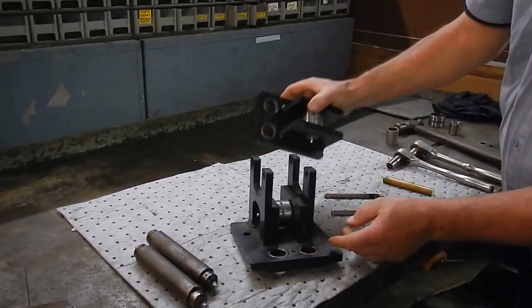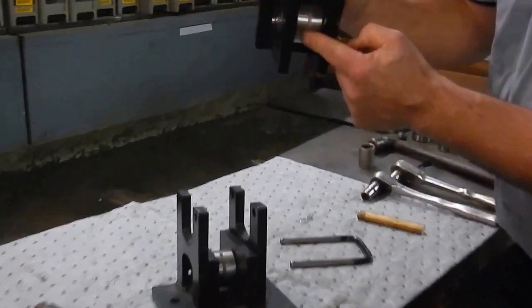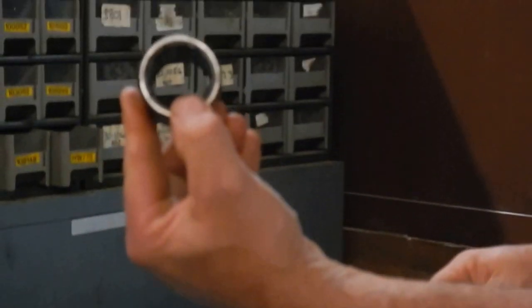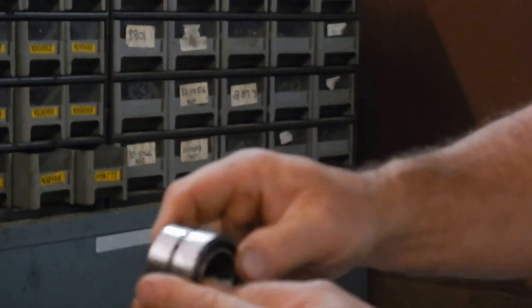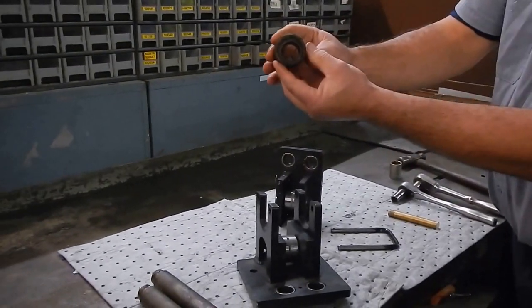So you've got the top half and the bottom half. This roller here is no more than just a bearing — you have the needle bearing and the inner race, that's all this is. So if we don't keep it lubricated, it's going to end up like this and not turn, and we're going to cut it right in two.